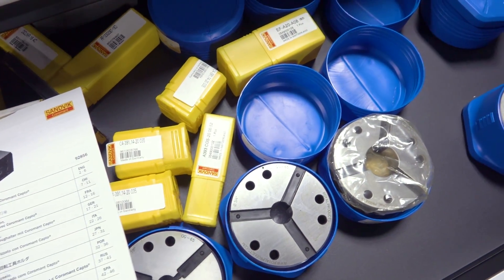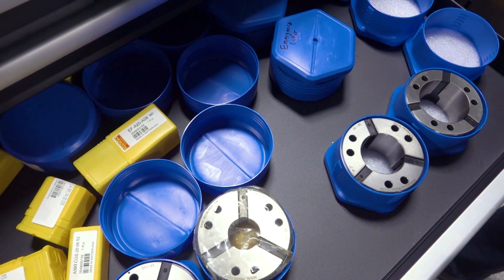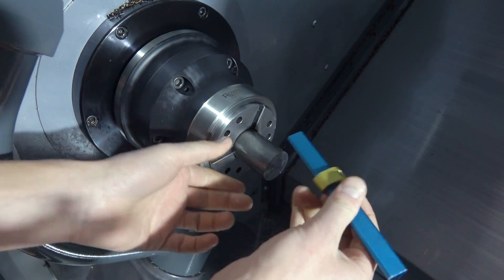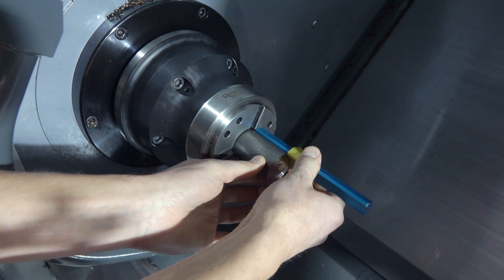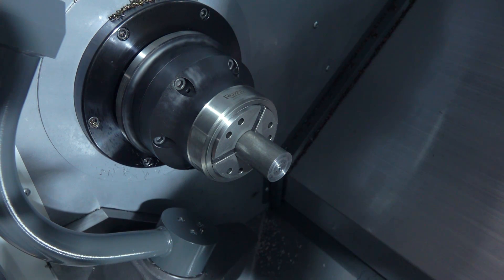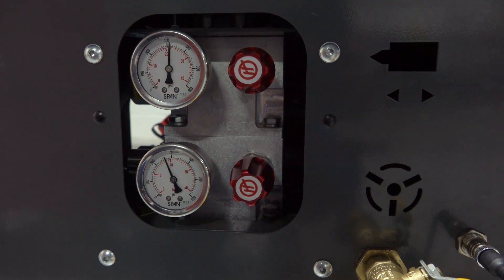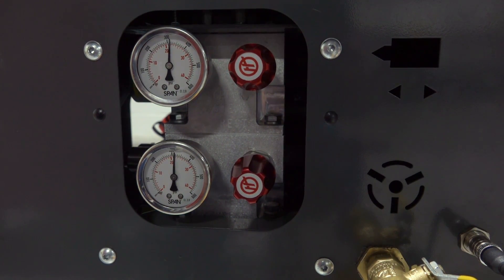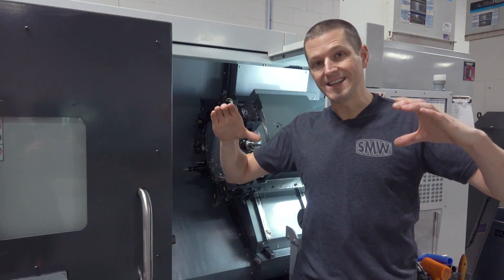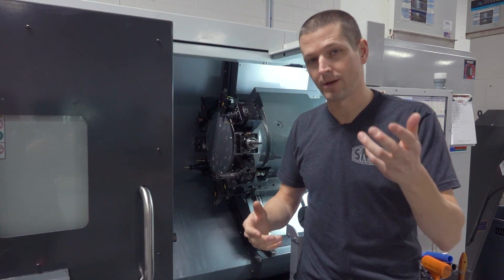We've got the Royal Chucks that we purchased right here, and that lets us quickly switch out to different diameters or custom or emergency collets. As small as you need to go up to over 2.5 inches — and 2.5 inches is the through bore on this machine. Once your collets are installed, we use stops a lot so that we can set and repeat an accurate length. Pressing the foot pedal locks it in, and you've got a hydraulic adjustment valve that lets you consistently apply the amount of clamping pressure you want. As an OD tightening chuck increases in RPM, it loses its clamping pressure — so this is stuff you have to keep in mind.